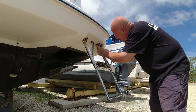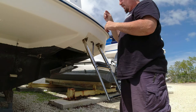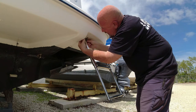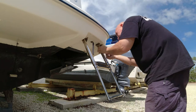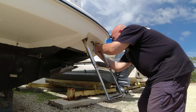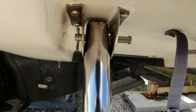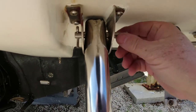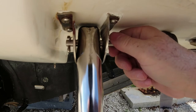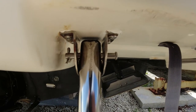It seems like it's doing the job — just checking that it's all holding in place. Here's the new pin and the cotter pin on this side. The cotter pin was a little difficult to install since the bracket moves around a lot. You have to put vice grips on one side and then get another pair of pliers on the other side to open up the cotter pin so it won't slip off. I think it's going to work fine — just got to test it out.